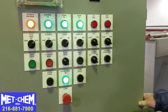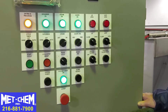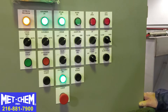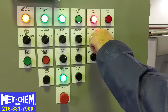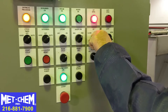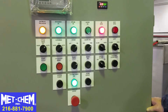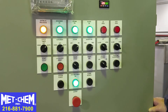We're starting a normal cycle again, but let's say somebody needs to check the sludge — something might be amiss or we want to make sure it's full. We can pause the cycle. The auger stops, the heater stays on, and the exhaust scrubber stays on. I can open the lid and inspect whatever issue we may feel is there. Once the issue's been resolved, if we just verified level for example, we close the lid. The timers are paused when this happens, so we have not interrupted our drying cycle time. When we put it back, the drying timers resume where they left off.